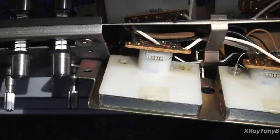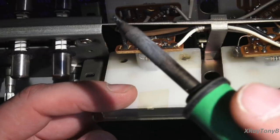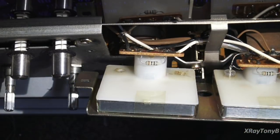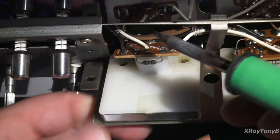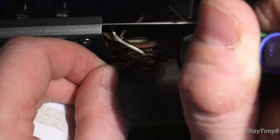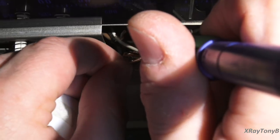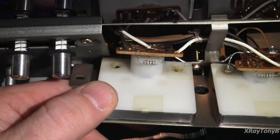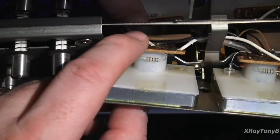The next thing you want to do is clean up the pads where you took these out, because solder is still on there. This is by far the hardest part of the job because you kind of need five hands to do it. We're going to go in here very carefully and clean that off — when there's no wire in there these are a lot easier to clean off, and the solder wick works much better. Let me do the other ones off camera and I'll be right back.